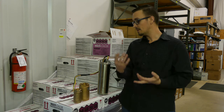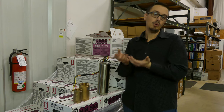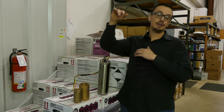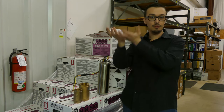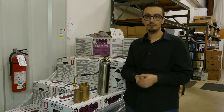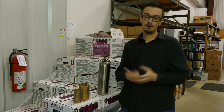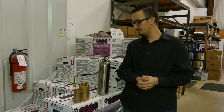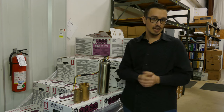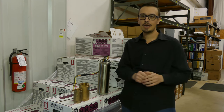Up thrust typically occurs when you have the impellers floating up inside of the pump. You've got a low pressure area and a high pressure area, so the impellers naturally gravitate upward and start rubbing on the diffusers, causing significant pump wear. Shaft wear is arguably worse because the shafts aren't intended to take that kind of wear, although a lot of pumps are designed to handle impeller contact.